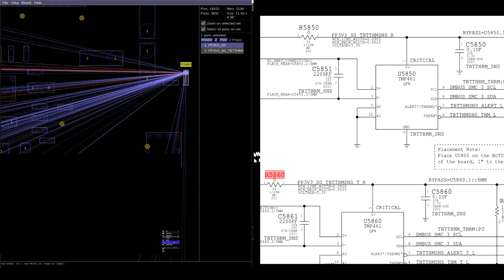And on the schematic, most of the time on these machines, that's going to be represented by this little thing at the top. So sometimes it's going to say V+, sometimes it'll say VCC, sometimes it'll say VDD, sometimes it'll say V-in. But to keep things simple, this is where voltage is going to be going into the chip so that it could turn on and work.